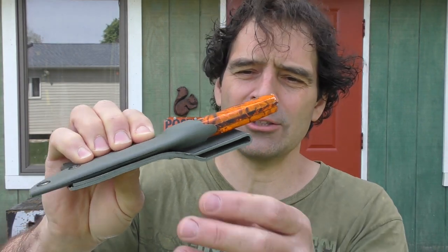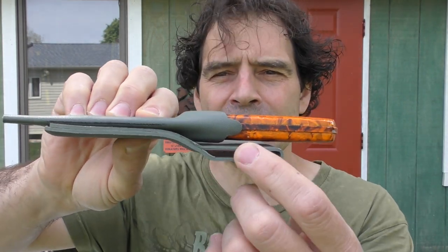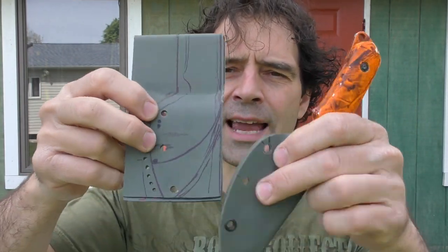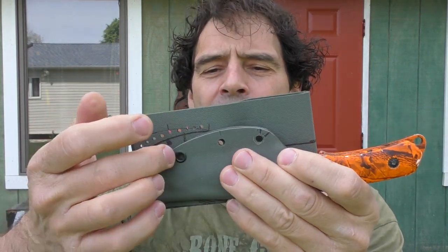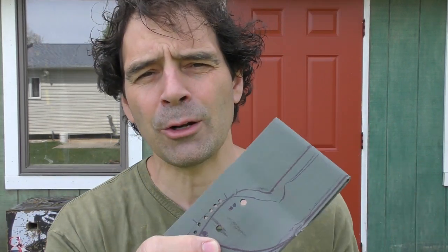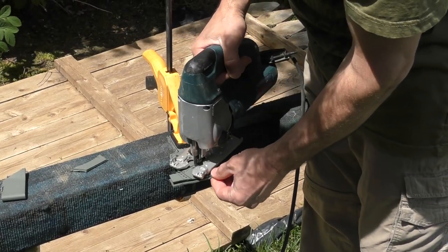This came out great. I took it out of the mold and you can see the belt loop came out really sharp. I've been playing around with tracing out the layout that I want — I'm only going to connect the first two holes so all the rest will be trimmed off. You can put Sharpie on here and it will come right off with denatured alcohol, unless you reheat it. If you screw up on this thing that's a great thing about Kydex — just throw it back in the oven and start over. But once the Sharpie's on there, if you put it back in the oven it gets baked in and it's there for life.